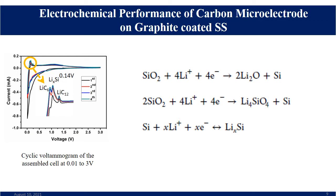In the typical pencil manufacturing process, the graphite is mixed with silica clay binder in different proportions to determine the hardness and blackness of the pencil needed. It is known that silica is also electrochemically active and improves the specific capacity.